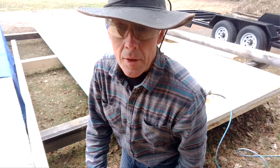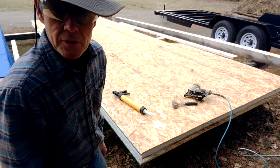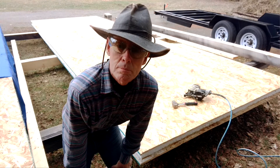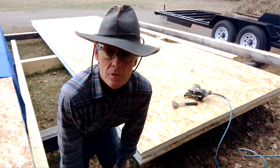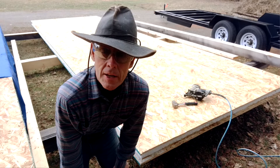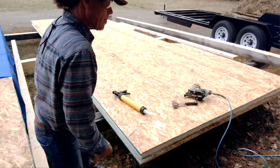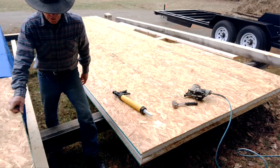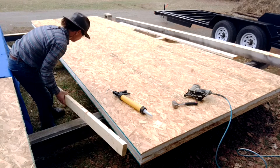Hey there, it's Kent and I'm building the Lightship for sale. I am processing the north wall panel and in this video I'm just going to show you how to put in what I call the lineal material — that's the 2x4s that run the perimeter of the panel and the perimeter of all openings. I'm at the top of the wall; the wheel well cutout is over there at the bottom. I have a 16-foot piece of 2x4.